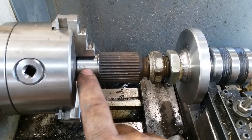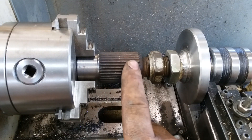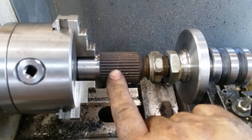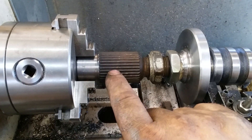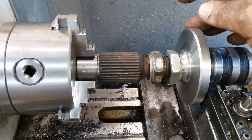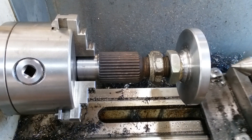Now this is pretty hard stuff, and these splines — you don't even want to try to cut through them unless you take the whole thing and anneal it, and then you run the chance of warping it. These splines are tempered hard — I imagine they're induction hardened. This stuff is harder than quenched and tempered woodpecker lips. So there you go — now you know how to make an adapter to do an alignment on the front end of your S10.